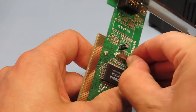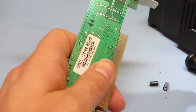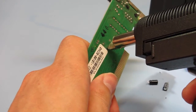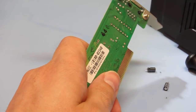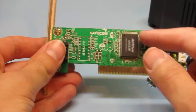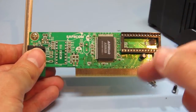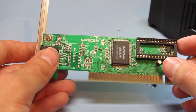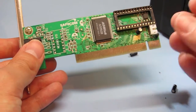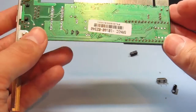If any of you have ever tried to remove parts from a through-hole plated PCB before, you'll know how annoying it can be. Depending on what it is, it's sometimes not too much of an issue, and it also depends whether you want to keep the part or not. For example, a DIP package — if you're not bothered about keeping the part you can just snip the legs and take the pins out individually. But if you want to keep the part, or you can't get to the legs — like a crystal or whatever — even solder wick doesn't work very well. And this just seems to make things a whole lot easier.